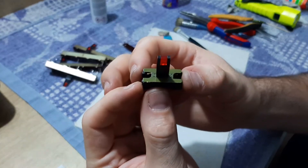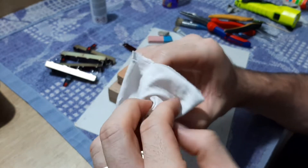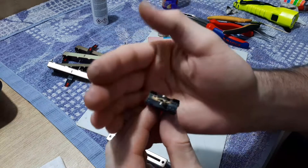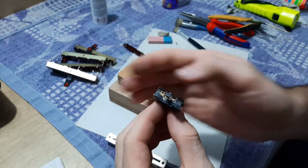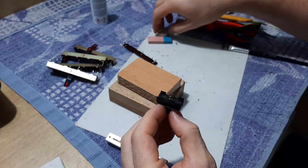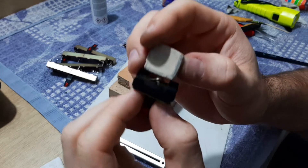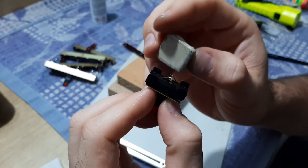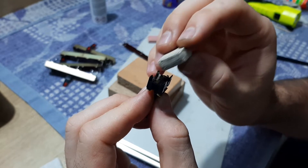I'll put the ball aside. You can see there's a lot of dust and lint here. I'll clean this side — now this side is cleaned. On the other side you have the wipers — there are four wipers, and each wiper has two small wipers inside them. I'm cleaning a little bit with the brush to remove the dust from the top, then with the eraser I'm cleaning these wipers. Pay attention — do it gently, because if you bend a wiper it's not a big problem, but if you break a wiper it will be very difficult to fix.